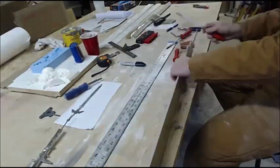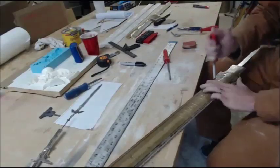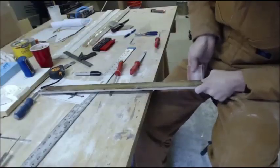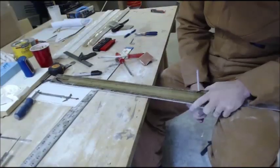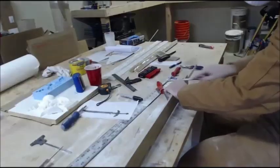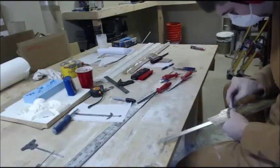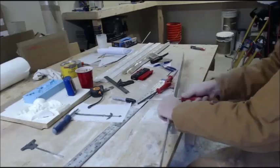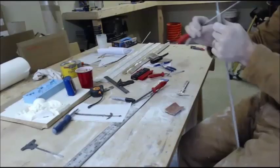Right now I'm fine-tuning the flare on the blade. It's a kind of unique blade in that it has these tabs right up near the hilt. It took quite a bit of hand tuning between a couple different files and then just muscle and sandpaper. It didn't take too long but it was a little bit of a process. You'll see me constantly rechecking the shape and the angle to make sure I have symmetry on both sides of the blade, which is absolutely key.